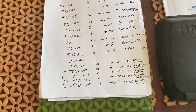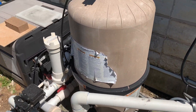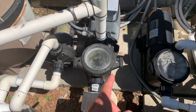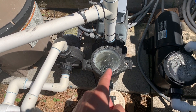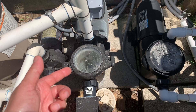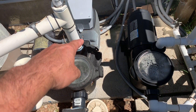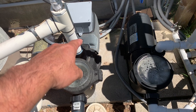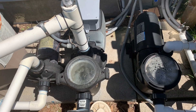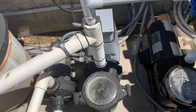As you can see I don't have a pump house — everything is exposed. I have three pumps: the one on the right is for my pond, the middle one is for my pool, and the other one is a booster pump for the pool. The main one in the middle is a Hayward. I have had three of those and they keep going out every three and a half to four years — typically just the control module goes out, which costs about $500 or three to four hours of my time to repair. I got tired of it.